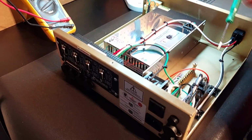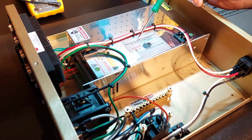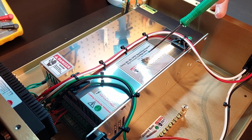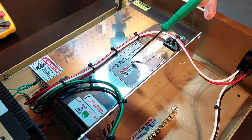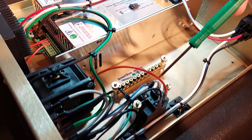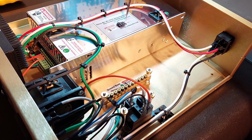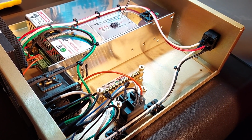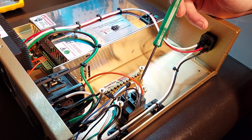Okay. First, we've got our relay, and we've got our 48 volt, 30 amp relay with servicing diagram right here. When I say servicing diagram, it does not get any easier than this. Everything is correctly allocated to the coloring of the wires being used on the physical relay. Pin 1 is blue lead. Pin 2 is GX16, which of course we can see the black lead right here. And then we have the white lead for the G540, and we have the red lead for the 48 volt coming in from our power supply.